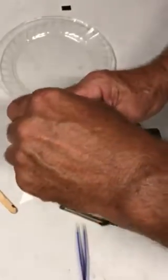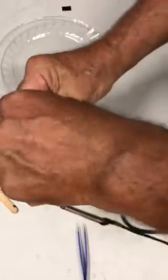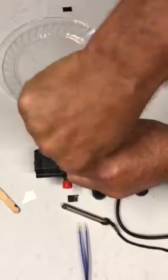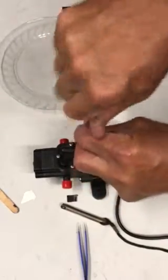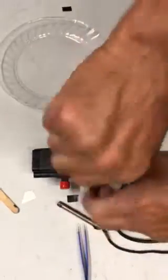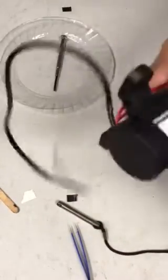It's not usually a pump problem — usually it's just something that gets sucked in as debris. I don't supply filters with the pump; I just make sure my chemistry is clean. But if you decide to put a filter on it, make sure it's in great shape, because if you get a piece of plastic that chips off or deteriorates, that hard product getting into the pump might damage your diaphragms and totally wreck your pump. Be careful picking and choosing the filters you put on here. Also, a lot of your filters might deteriorate in the presence of chemistry — like a brass filter might deteriorate because of caustic or acids. You don't want that getting into your pump. I don't over-tighten — I just snug them up.